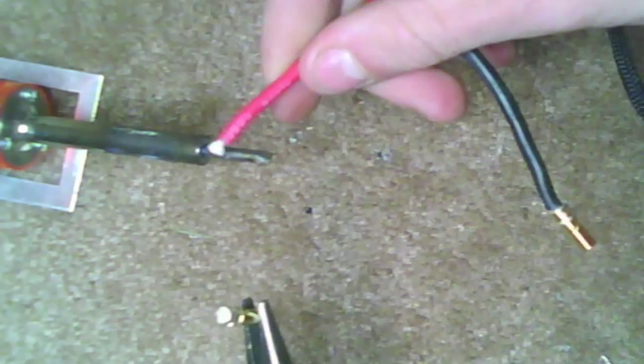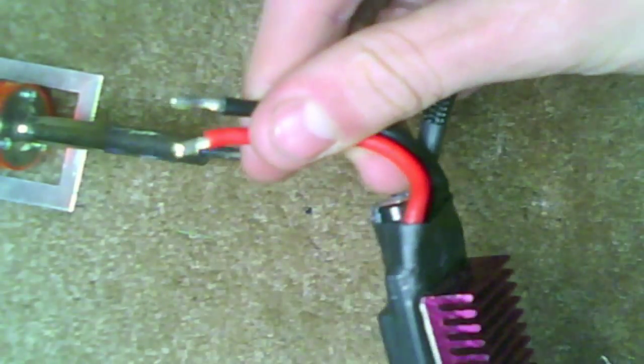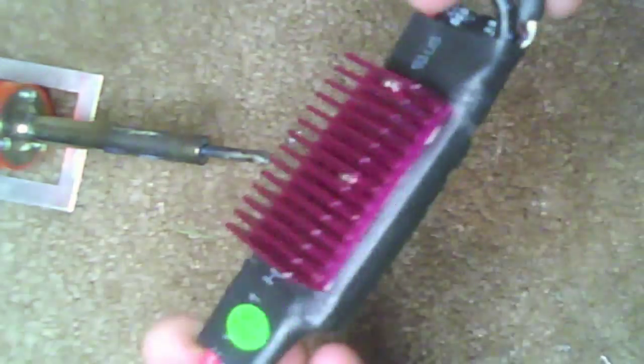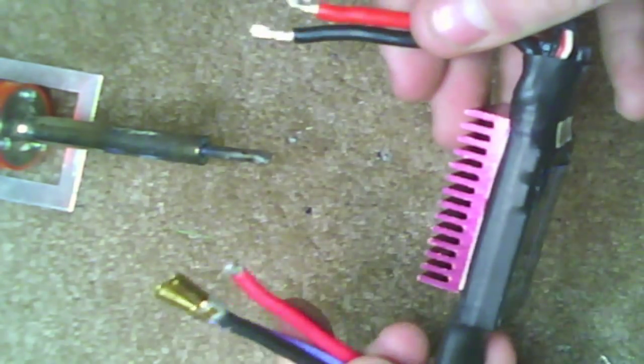This lead is nice and empty. One thing I always do — I am going to keep this laying around — for safety reasons I will slip some heat shrink on the end of all these little wires, just so they are not exposed in case I want to use this for later. Of course this one is damaged so I will just keep it for scrap. But if you are just swapping out for a newer ESC, just take care of your wires and put some heat shrink on those ends. Now we are going to go ahead and solder the new Deans on to the castle and then the motor leads.